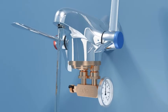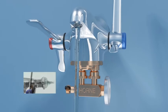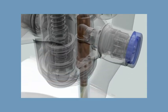It is important to note that this procedure, however, does not replace the need for periodic system flushing at full bore, where the increase in water velocity serves to shear biofilm from the internal pipe surfaces and remove it to drain.